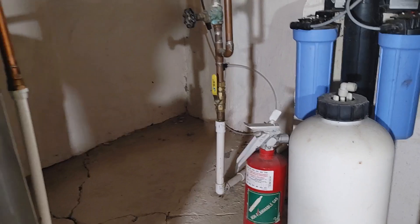What we're going to do today is install one. To make things quick and easy, I'm going to use SharkBite since it's not behind the wall — it's accessible and I can keep an eye on it. SharkBites are usually very good, but they might not last as long as copper or PVC. Since it's very exposed, I can see it if there's an issue.